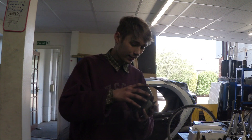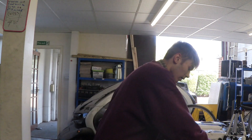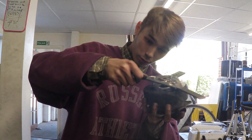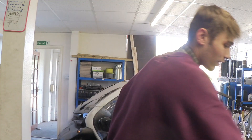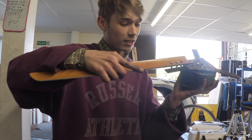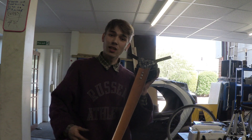Let's see how this gets put together. I've got my motor with my adapted plastic case. This goes on and it's specifically keyed, then an M6 nut goes over the top to keep it nice and solid. Then we grab our little adaptation piece, stick it into the drilled holes so it sits nice and flat and is free to spin. Then we grab our blades, fit them into these bars, and once all of them are fitted on, we've got our little wind turbine.